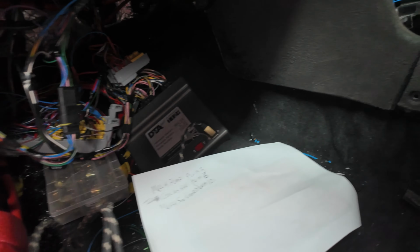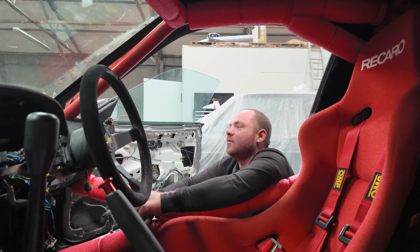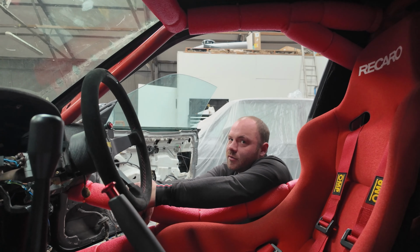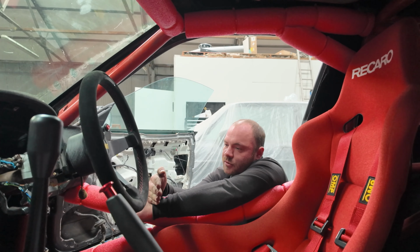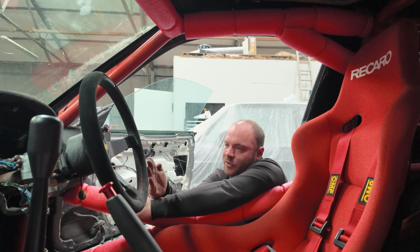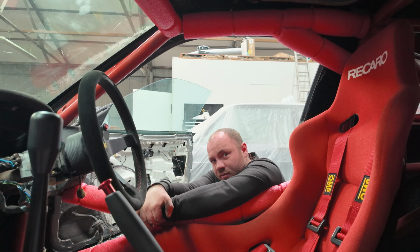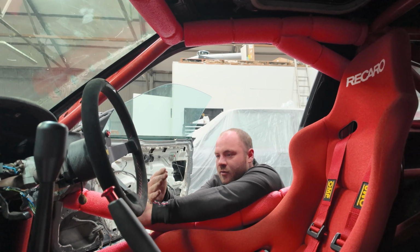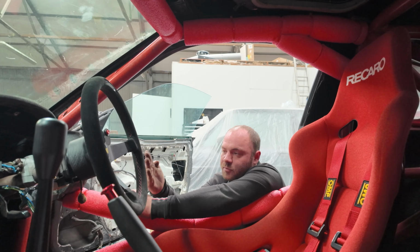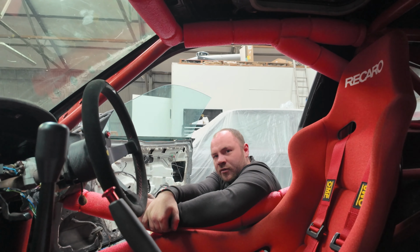Right, so there's the ECU down there, everything's plugged in. So what's happening, pal? Fighting battle. So the crank sensor pickup was wrong on it, the location of the sensor from when we swapped from the manual flywheel to the automatic flex plate. The flywheel and the flex plate, that's the difference between a normal gearbox and the automatic. So the flex plate was off the auto for the engine, and the sensor ring was further back by 2 mils, so we weren't getting crank position because of that.